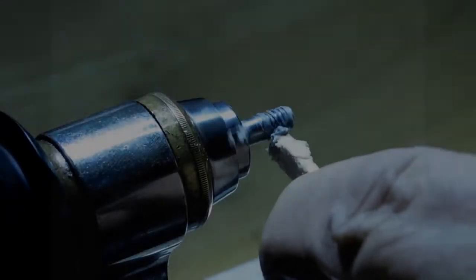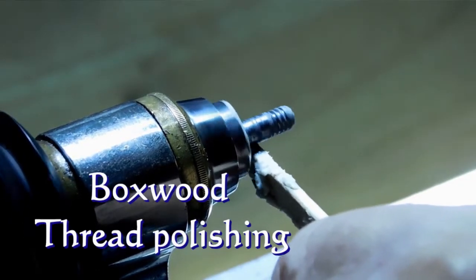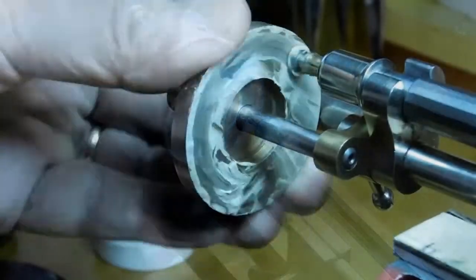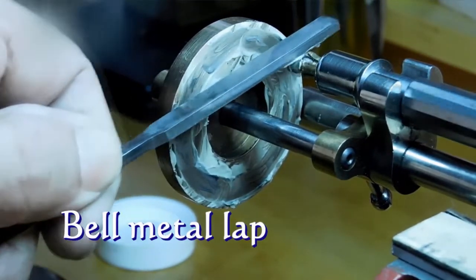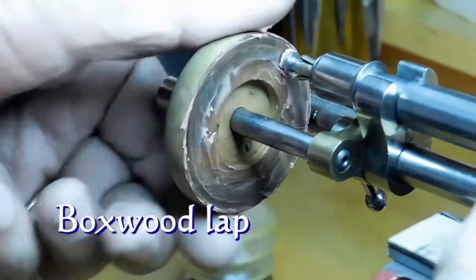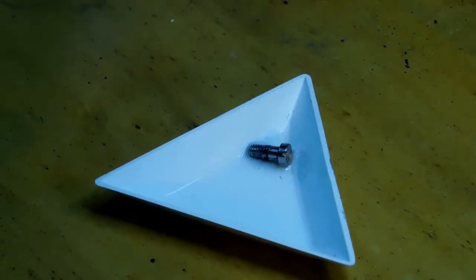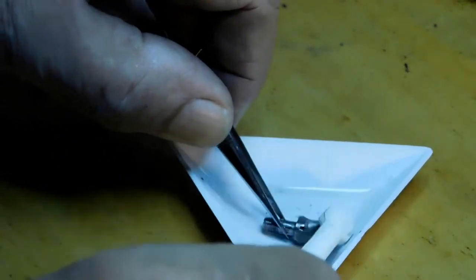I forgot to mention — this screw was hardened. I hardened it and quenched it and forgot to take pictures. So this is a hardened screw now. It's in my watchmaker's lathe and I'm using boxwood to clean up the threads and get it ready for polishing. This is the polishing on the iron lap that I made to fit on my lathe — it mostly squares things out. Then the bell metal lap does most of the work. I really like the bell metal; it does a really nice job. Between each step you're cleaning it with lighter fluid, but now we're down to the last one so there's no more touching the screw — a fingerprint would ruin it.